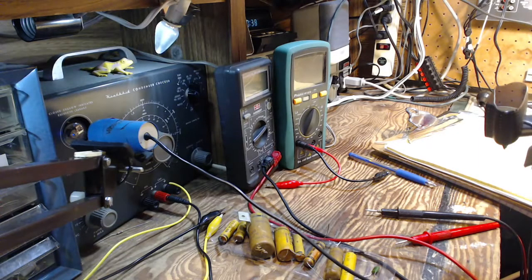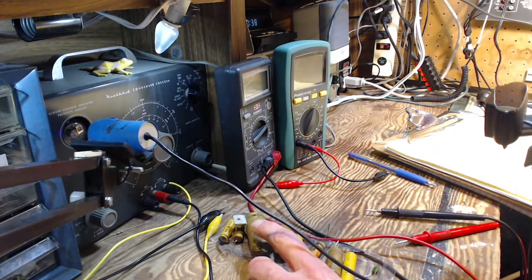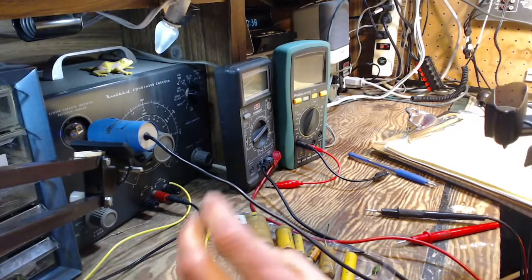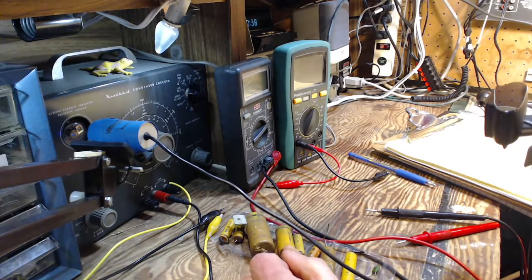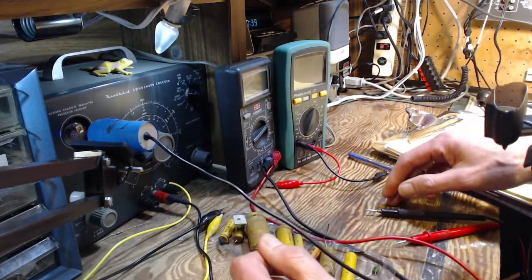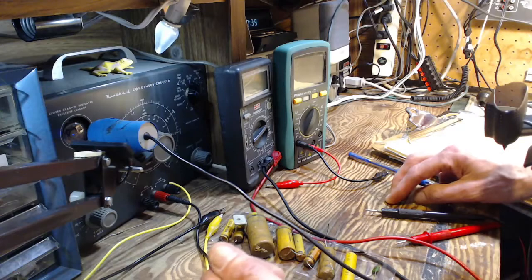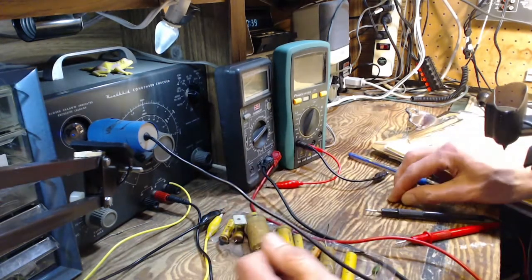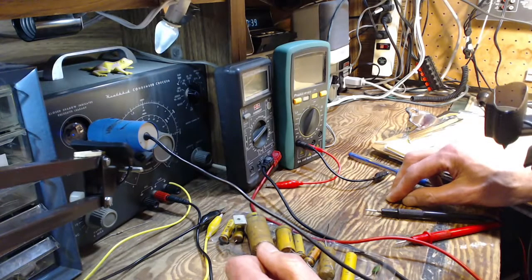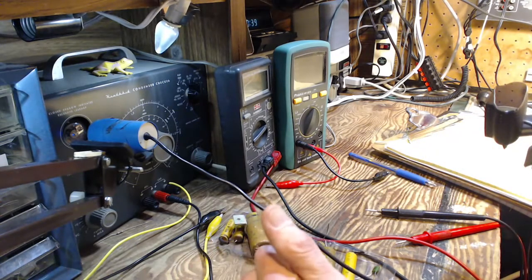Now, this is a very commonly understood effect with capacitors. It's what affects a big capacitor, let's say an electrolytic capacitor, though none of these are electrolytic. If you charge a big capacitor, especially if you keep it on charge for quite a while, you can then remove it from the supply and briefly short circuit it, maybe put a clip lead on for two or three seconds. You might even see a little bang of current jump out, and it looks pretty convincing that it's discharged. Then remove the short from the leads. A few moments later, you can hook up your voltmeter and you'll see a voltage. Sometimes you'll see it rising. This is the relaxation voltage showing up.